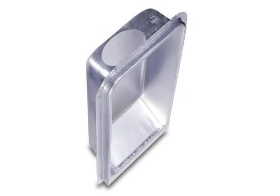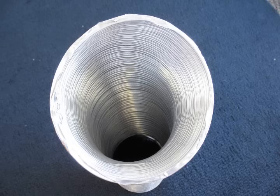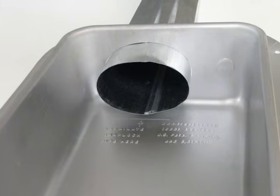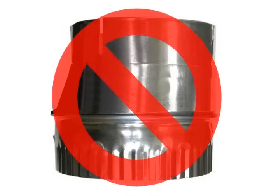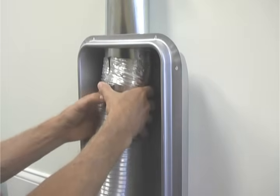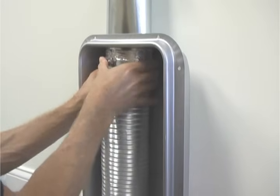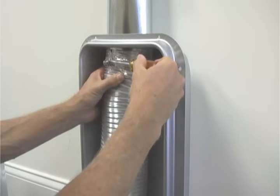If you have the Model 350 dryer box — the one with the oval hole — it can be a concern getting the round flex transition hose over the very oval shape of the rigid pipe that penetrates the dryer box. To be clear, there does not exist a fitting or adapter for this. The flex transition hose will fit over the oval pipe; the trick is to prepare the pipe as discussed earlier and then squeeze or deform the flex similar to how you would grip a large hamburger. Remove any sharp burrs and simply work the open end up, on, and over the rigid pipe.